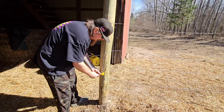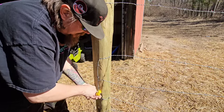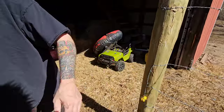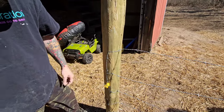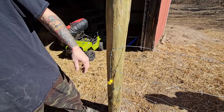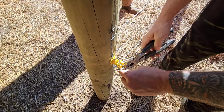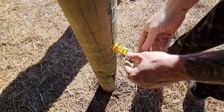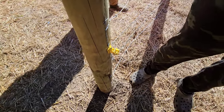What we're going to do right here is make a loop — this will be our kill point basically. I'm just going to stay on the inside of that so we can attach this piece to it, just like this. We'll be able to just pop this off, hang it right up here on the nail. To activate the fence we're just going to pull this through here and attach it right there. So when you disconnect that, your whole entire fence is no longer hot.